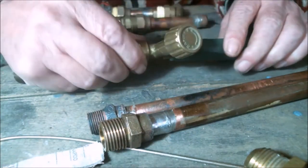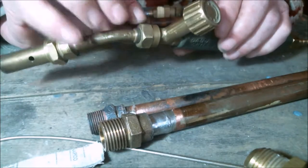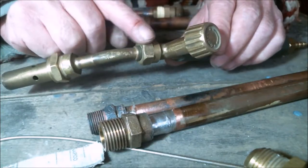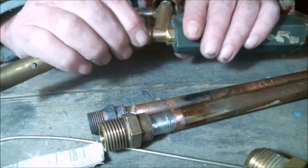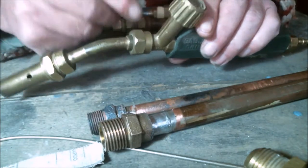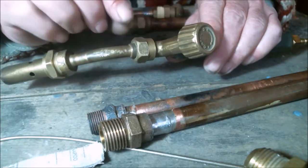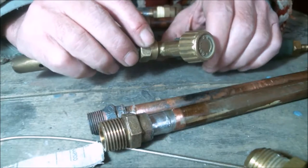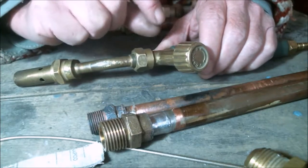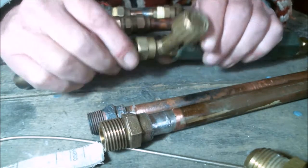These kinds of joints don't require any interposed materials. If you tighten the connection fully and it still has a leak, the only option is replacing the fixture, because one of the parts has a scratch big enough to let gas through however much you tighten it.